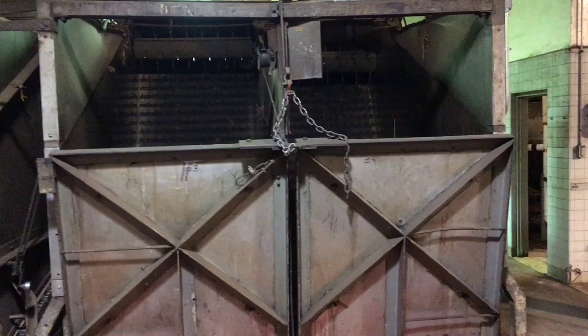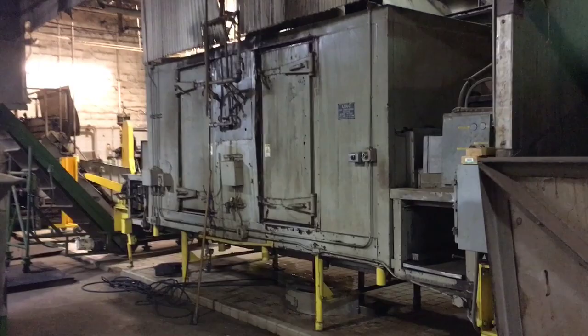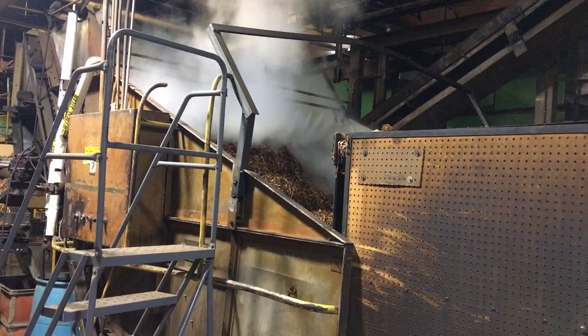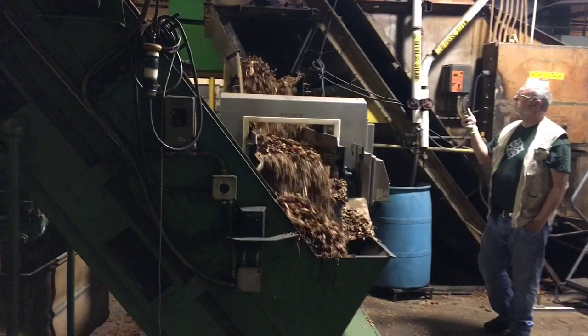It'll then be turned over and hit again for another 24 hours. That process makes the sugars in the tobacco change the flavor of the tobacco that you will get. These are mixing chambers which are also breaking out and steaming the tobacco. All this process is really just rehydrating and loosening the tobacco so that it can be compressed and then cut.